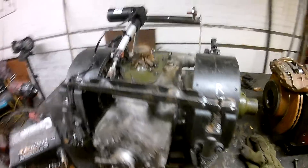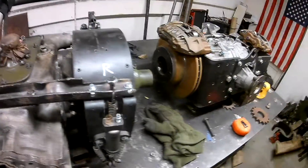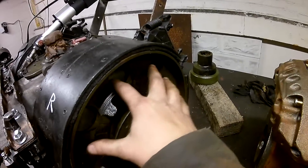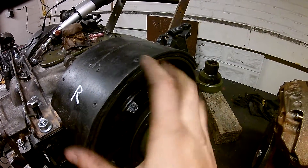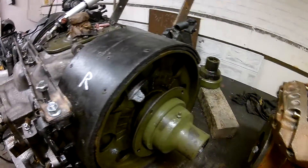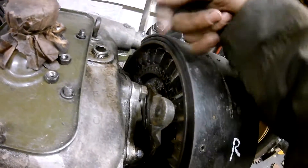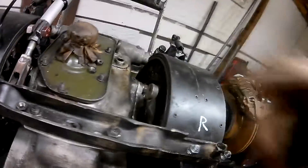The actual construction — there's a spiral bevel gear set that transfers your input to 90 degrees on a solid cross shaft, which then splits it into two clutch brake packs. The clutches and brakes are set up kind of like a dozer, where there's a clutch basket inside the actual brake drum. There are 18 steel-on-steel friction plates — nine driven and nine driving. The driven ones are meshed into the brake drum with splines. To disengage the clutches there's a throw-out arm that rotates on a ball ramp, and when you turn it the balls go up the ramp, pushing the coil springs out, which separates the clutch plates and allows the clutch to slip.